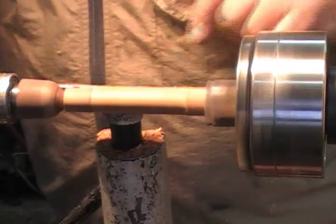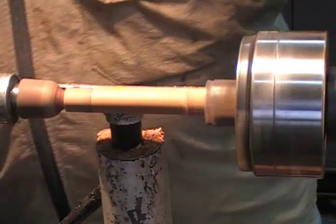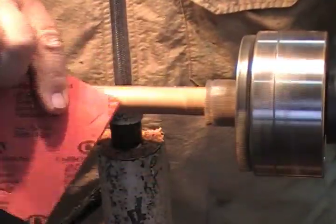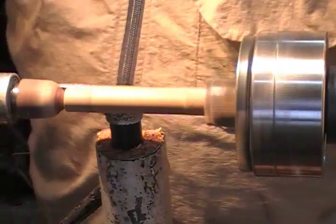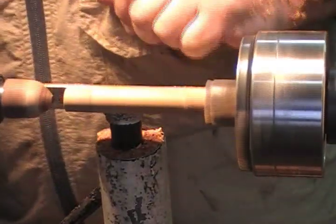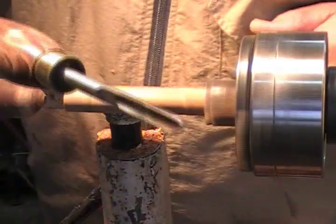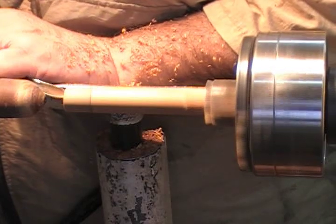Now, that's really nice. Now, I can sand this right now without slowing it down, but let me tell you what this is like. This is like trying to sand a tabletop while you jog by holding a belt sander. Doesn't do a lot, except you can tell somebody you sanded it. Alright? Back the stop off, fingernail gouge, with the Ellsworth grind on it. Clean up this.